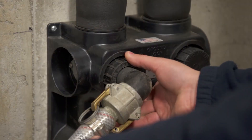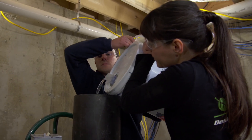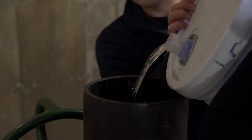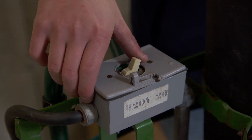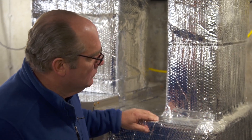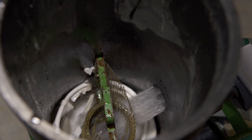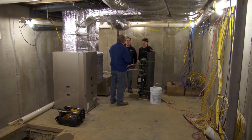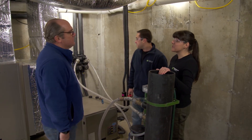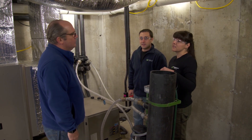The flush cart is connected to the supply and the return lines. It's important to get all the air out of the system, otherwise there could be an airlock. The fluid goes all the way down into the well and eventually back up to the heat pump. We have to let this flush for two hours, then move it over to the other well and flush that for two more hours. The flushing gets out all the little bubbles and also mixes the antifreeze.